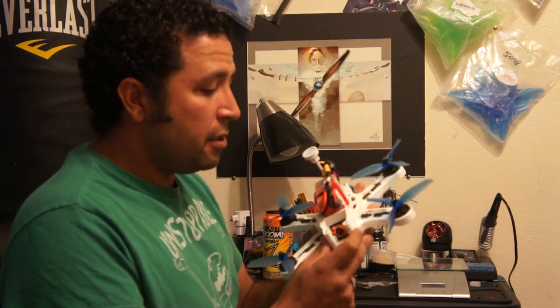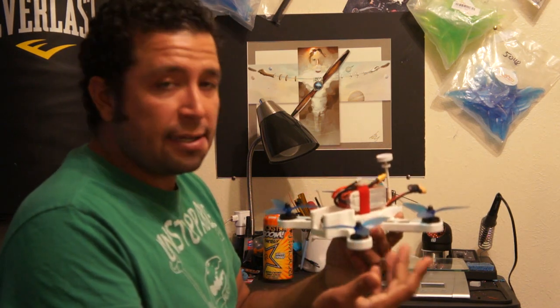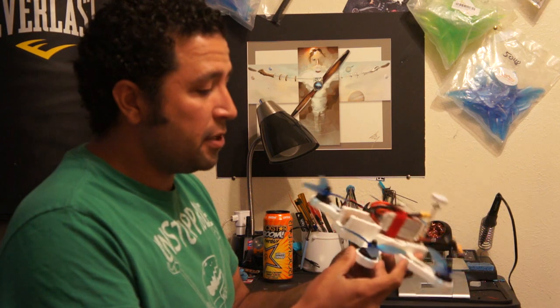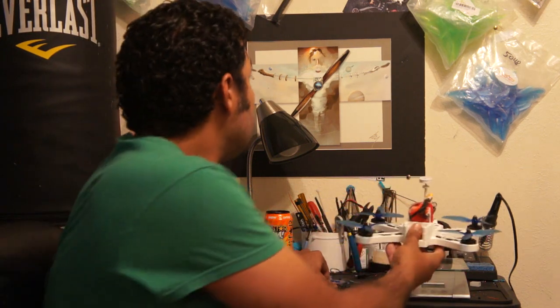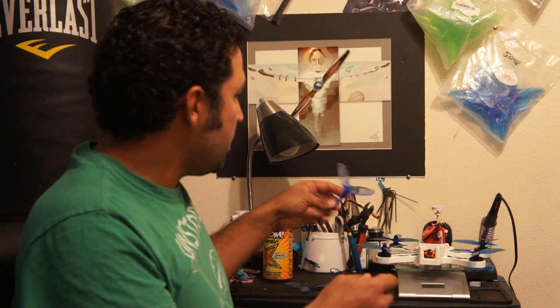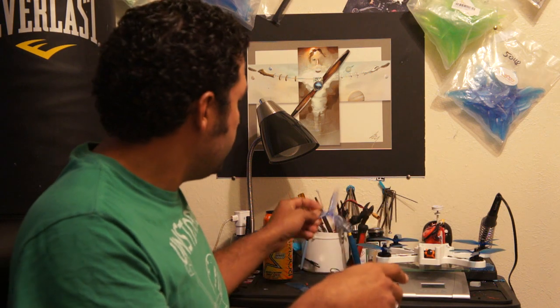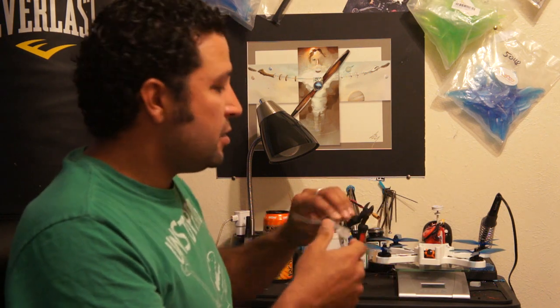The weight, that's in the cons. I'll get to that in a second. Prop-wise, on these little cheap motors, they're only like $8.99 a piece, which is insane. 2205, 2300. I started with the HQ 5x4x3, or 5x4.2x3, and they didn't have enough bite. And I shattered a bunch of them, so I moved up. I also tried the Gemfan Wind Dancers, the 5042, same. I tried these Racecraft clones of the Azure Props 5048s. These had some great bite to them.